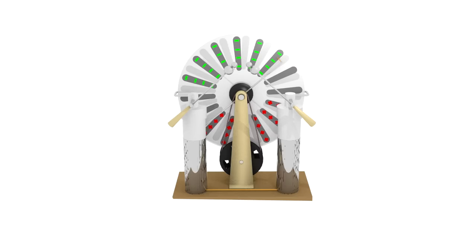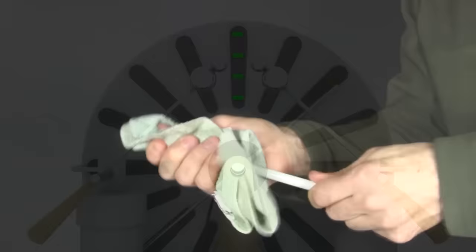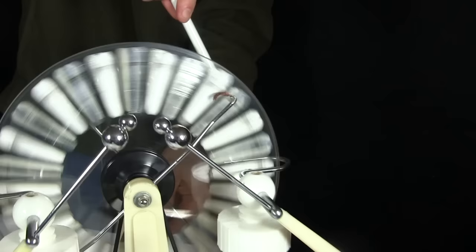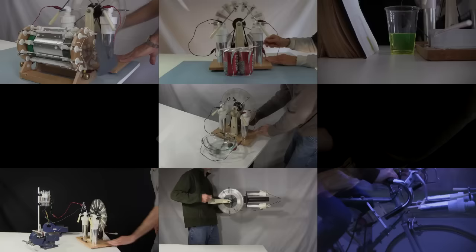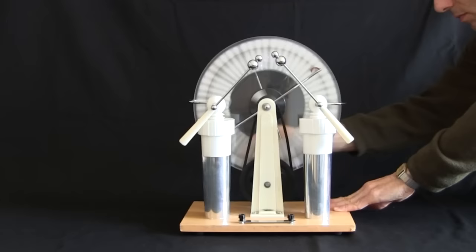There's just one more thing to mention. We started this whole thing by saying there has to be a charge on a sector somewhere for all this to start. But what if there isn't? In that case, you can induce a charge using the triboelectric effect. Basically, rub a cotton cloth against a plastic rod — that charges the rod negatively. When you bring the rod near, but not touching, a sector where the sector on the other side is touching a neutralizer brush, that causes the necessary induction to charge that sector through the neutralizer bar. That gets it all going. And recall that I've used this Wimshurst machine for many demonstrations — there are links to those videos in the description. And that's how a Wimshurst machine works. Well, thanks for watching.